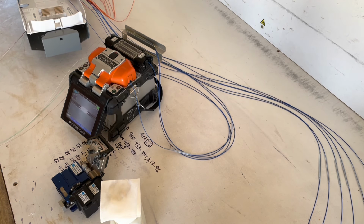Now I'm always going to put my feed side in first. That's usually these lighter coated fibers. And I'll use the drop line side to somewhat hold this side down and protect it. Get it in there like that. Blues next. Set that over top, forcing those fibers to the bottom of the tray. And in there, you can give it a little turn, a little twist and turn will help equal out all the fibers in the tray, allowing it to look a lot better.